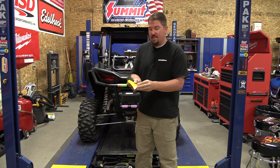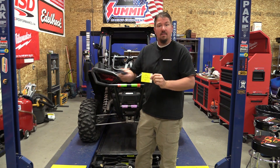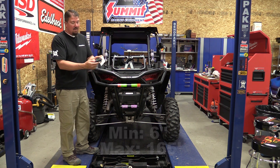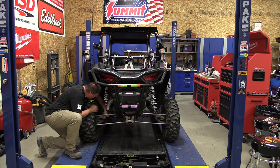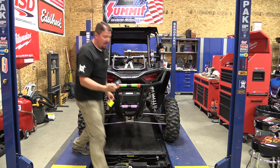We're going to go through and see if everything is square. These units come with a little sticky paper target — if you're in a corner or any area where you can't get between different places, that's perfect. One downside to this unit is it's only good down to six inches, but the first three and a half to four inches is taken up by the unit itself. So we won't do any measurement below six inches. What we do is come in and find a reproducible reference point on each side.